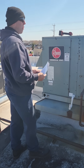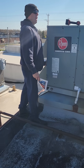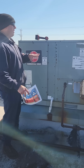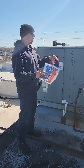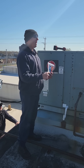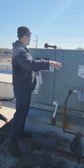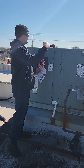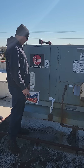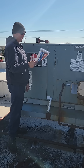When I talk about fan motors — when one fan runs, they both run. Let's see what happens when I turn it on. After you clean a coil, the fans are on a cycling switch and they're not always going to kick on right away — that's normal. You'll start to see the coil start smoking and steaming, totally normal. It's got to burn off all of the water. So when this thing gets up to pressure, it's because it's cold outside. It'll take a minute and the fans will kick on. I want you guys to kind of hover and watch what's going on when the fans kick on.